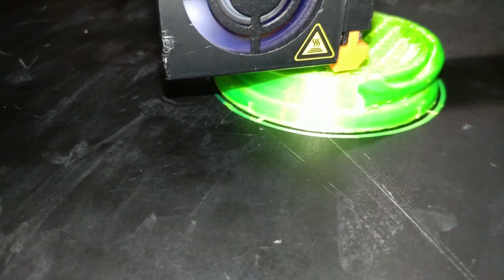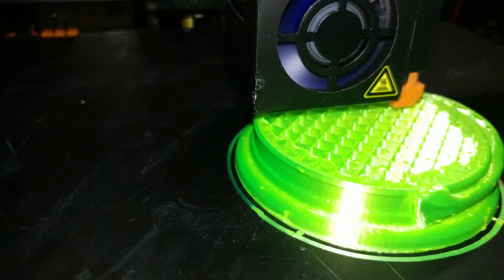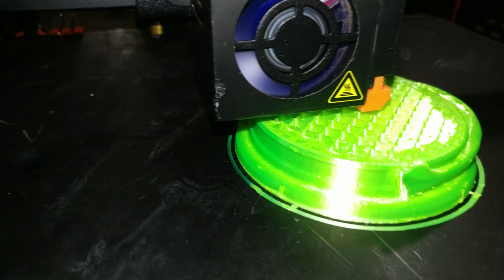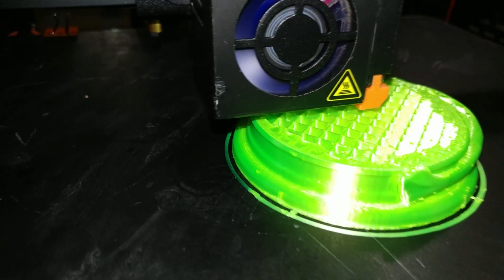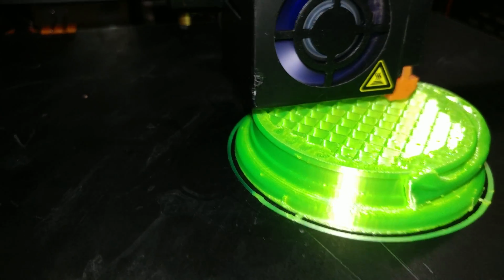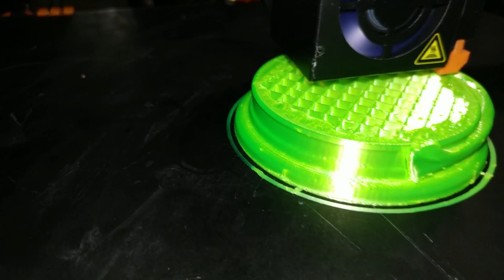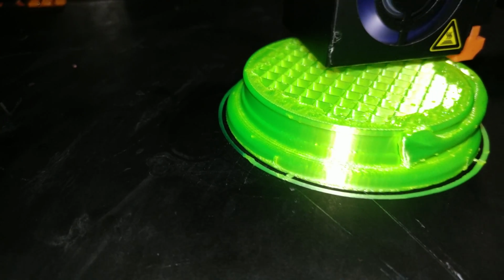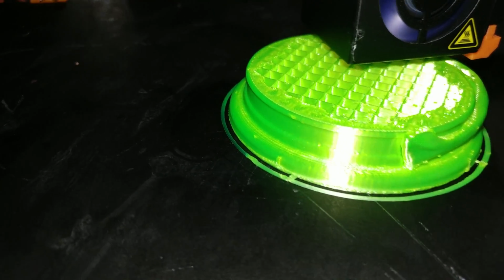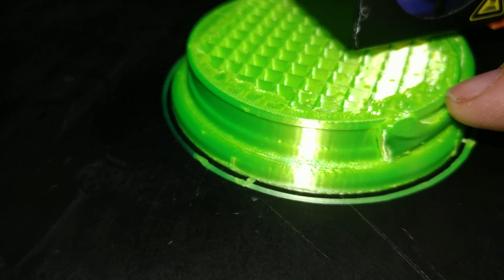And you don't make it easy to find the spots, because you don't do it by layer, you do it by stupid millimeters. I can't just go to layer 573 and say, okay, do a solid layer at 573. No, instead I have to find out it's 573 somehow by scanning up and down the model, and I can't use the end, I have to use beginning, because if you use end, it just says one of the whole number of lines, but if you use beginning, then it tells you the actual line that you're at, and I have to multiply that by 0.2 to find out where the damn layer is in millimeters and tell it to do a start-stop there.